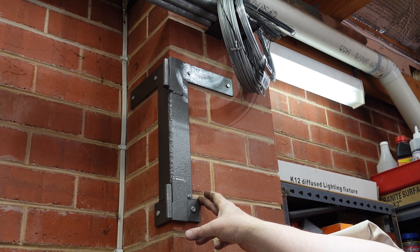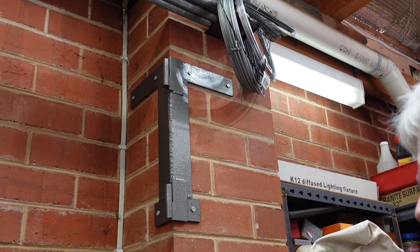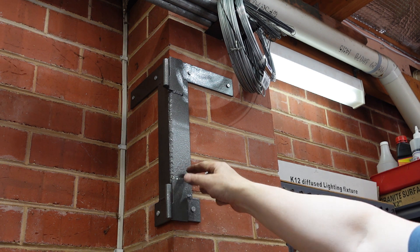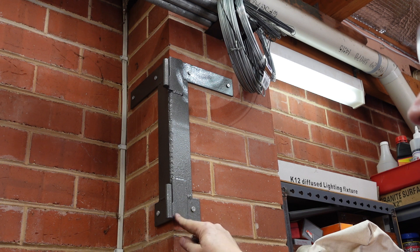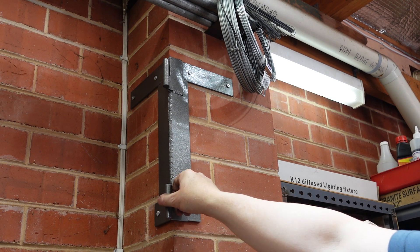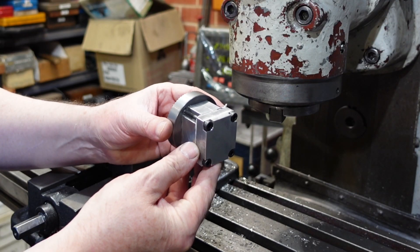This is the wall bracket for mounting the boom - nothing terribly exciting here, some 50 by 3 flat welded up, holes there for screw-out raw plugs. I prefer this sort because you can screw the inside out and get that out easily. Because I'm wrapping around a corner I need something that'll come in from the front, otherwise I could have used some dyna bolts I guess. These hinges are just a lift-off gate hinge, welded on there, and the boom drops on there.